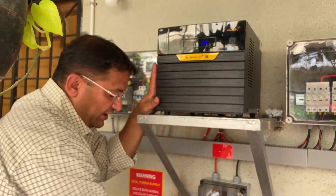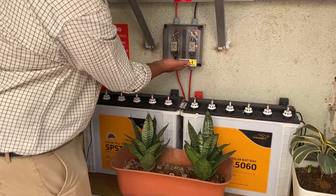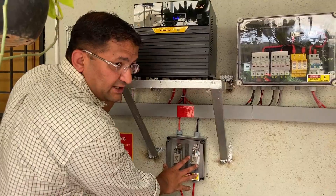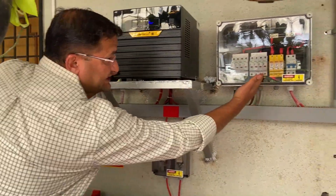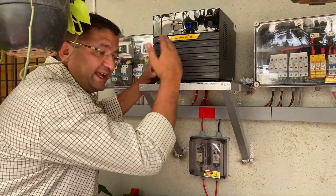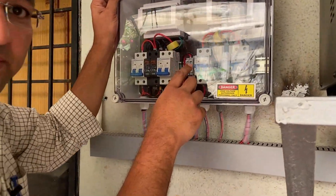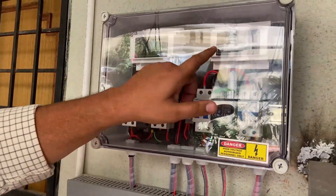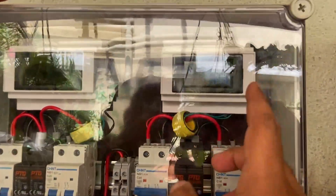This is a 24 volt system, so we have two batteries of 150 AH connected in series to make 24 volts. The battery is connected to the inverter through a fuse. The DC goes into the inverter, and the AC output goes into the output box, where we have an MCB, a surge protection device, another MCB, and a meter. This meter measures various parameters of the output — currently the voltage is about 217V and the load is 0.46.